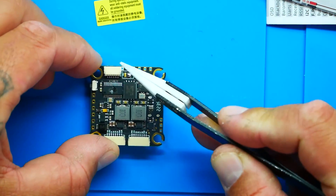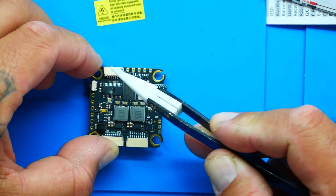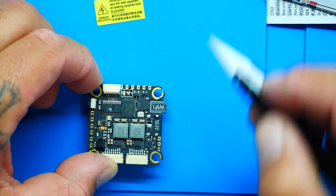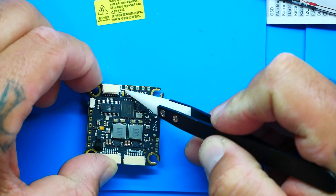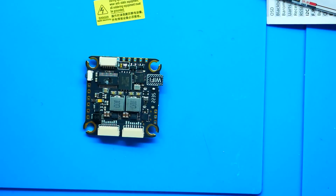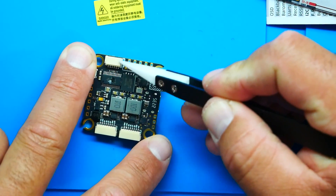You've got air unit support — I can wire up my air unit or my Vista directly. On the back side there's a designated plug just for DJI, so I can plug in here and go to my Vista or my air unit. What makes this awesome is this little jumper pad right here. Currently, stock out of the box, it's jumped to 9V — so you can run your air unit without needing an external BEC because there's an onboard BEC. But if you want to run the Vista or need full voltage, you can unbridge this and bridge over to the next pad to get full voltage heading out the power pad of this connector.